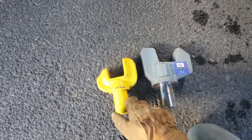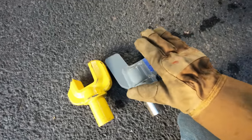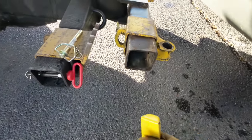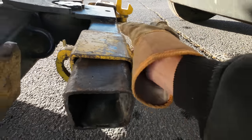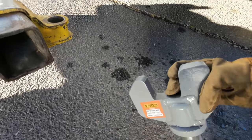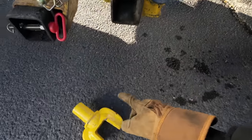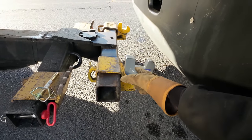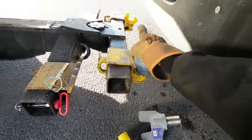Check this out — in a previous video I said these two sets of forks were duplicates as far as what they fit, and they are, so I wouldn't need to carry both. But it turns out when I flip these receivers to the low side, this fork hits here and doesn't sit all the way in the bottom — that's no good. Whereas this other fork sits nice and flush and works. So it turns out I do have to carry both sets of forks. When the receivers were on the high side this would not be an issue, but it is on the low side.